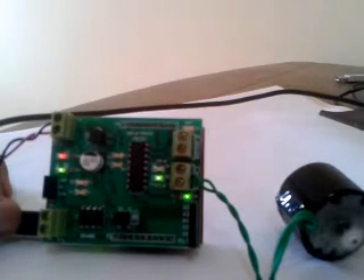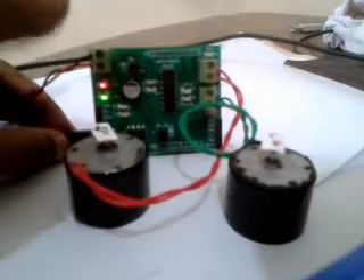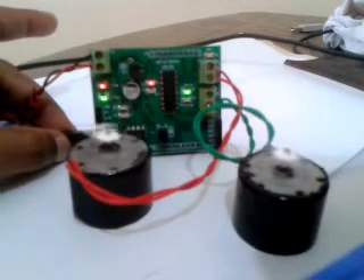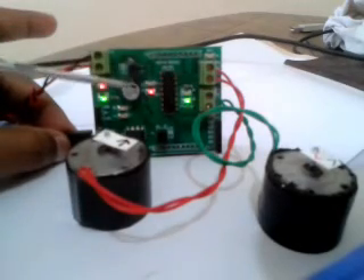Now for controlling two motors, I have connected an extra motor using the red wire, connected to motor_R. We will be using the L293D for its full capacity. You need to use the L293D dual motor controller .c file from the zip file downloadable from my website. Compile the code and run it by pressing F5. The two motors will rotate in one direction first, then stop, and rotate in the opposite direction. You can see the logic levels at the 1A and 2A pins — this LED enables the right motor and this one enables the left motor.